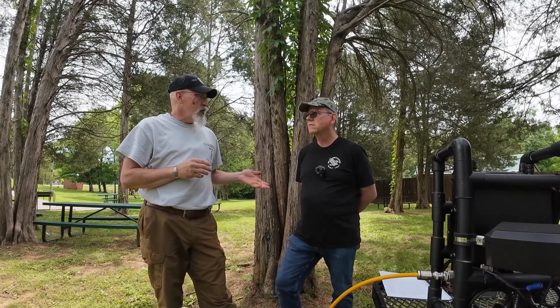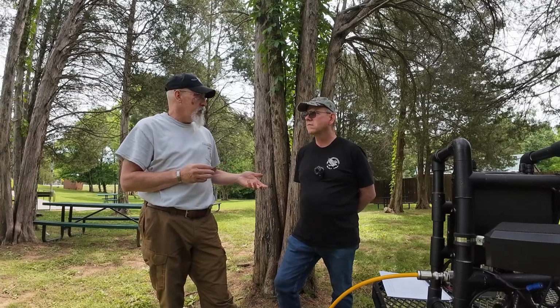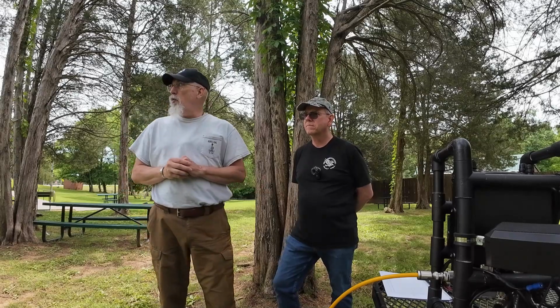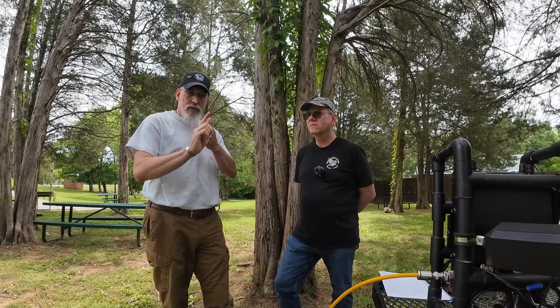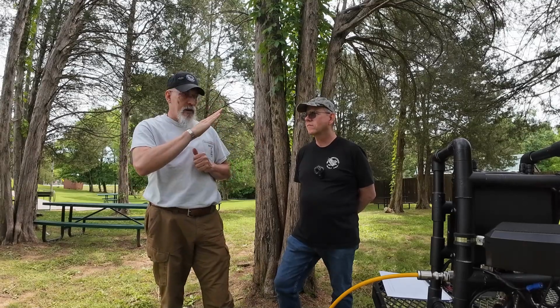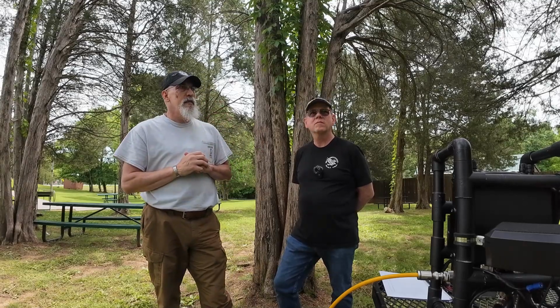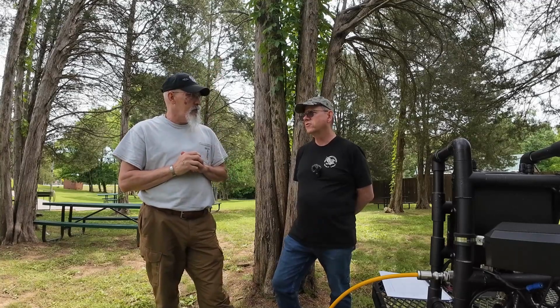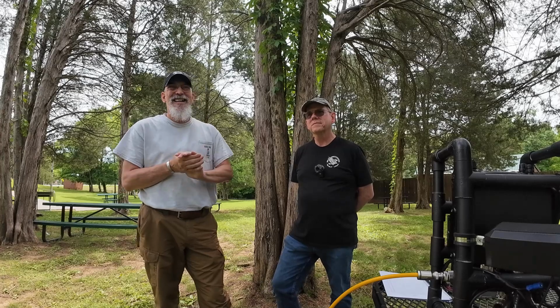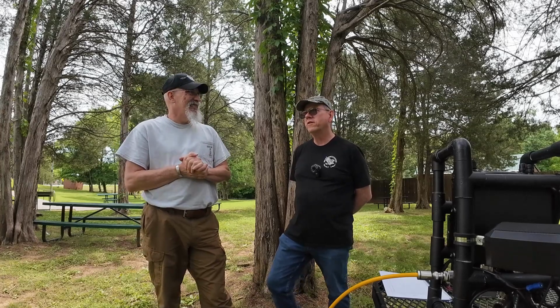And then maybe next time what we could try is we could break out our end-fed half waves. Yeah. And we could run the wire. We'll run the wire north-south. That way we get an east and west off the side, because we'll be running it in a slope configuration. Right. And I'm pretty sure that should give us more of an east-west. I'll have to run something shorter than mine. Mine's 133 feet. 130.